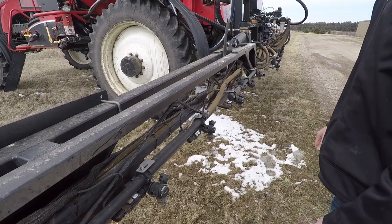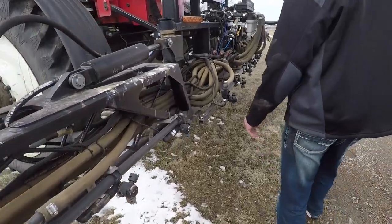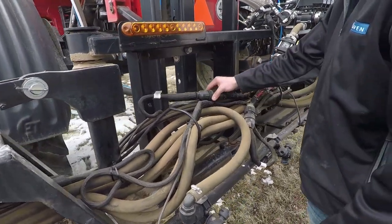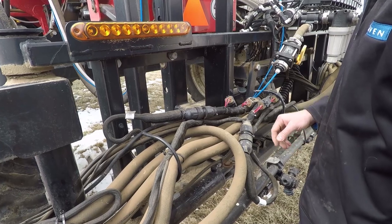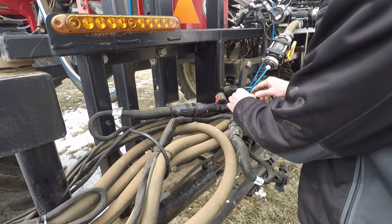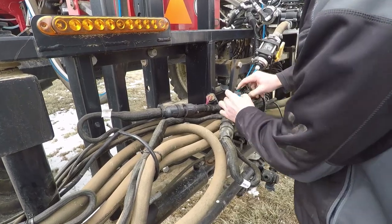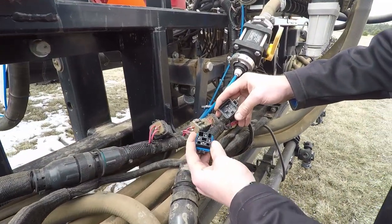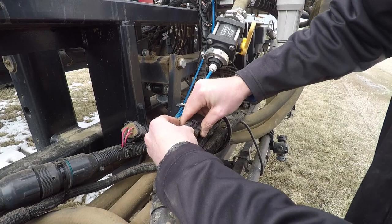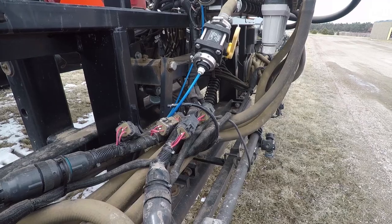Going through here, make sure every nozzle has a tip on it and make sure they're all the same - whether it's an 08 or 04 or whatever style you're using that day. Just make sure they're all rotated to the same orientation. Here we're just checking the relays - these would be the relays for the nozzle power. There would be three relays on every system. These are the adapter cables, and for the newer cables that have the relays built in, there's typically an external relay box with the fuses. This one has three on each side, and a lot of the newer style cables just have three total.